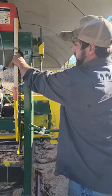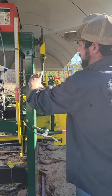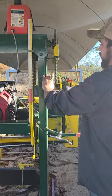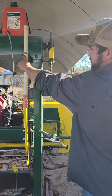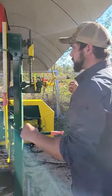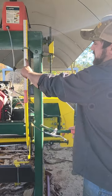So if you have a ten-inch cant and you want to start taking one-inch boards off of it, you have your line over there for your quarter scale — just rotate that back and drop that down so you're on your line, and that will give you the true one inch. Then you have your five-quarters so you can do inch and a quarter, and then your six-quarters for inch and a half.